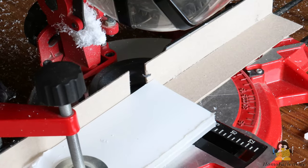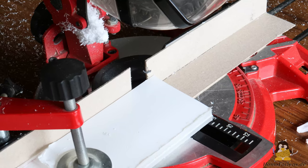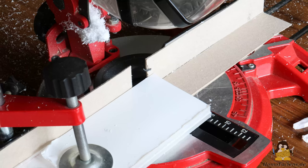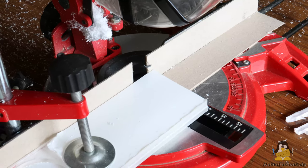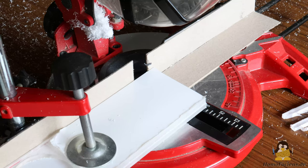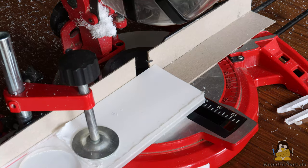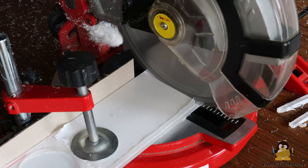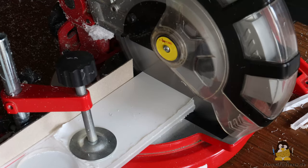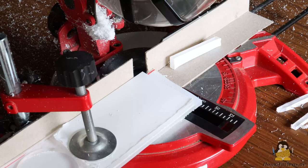The next experiments are meant to estimate the energy required for grinding. Instead of a grinder, electric cutting tools are used. Version number one is a circular saw, used to cut 6mm thick polymethyl methacrylate — PMMA for short, or acrylic glass — but two panels at once, resulting in a material thickness of 12mm, done in just 3 to 4 seconds.